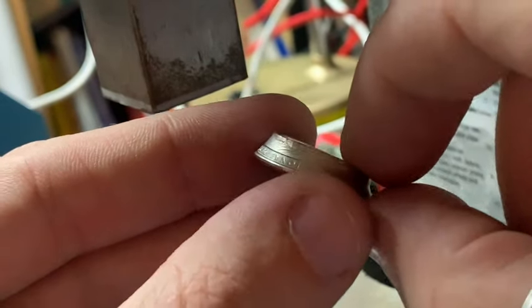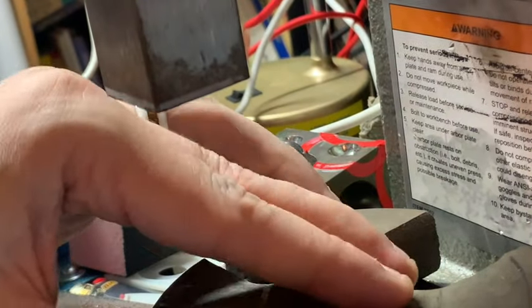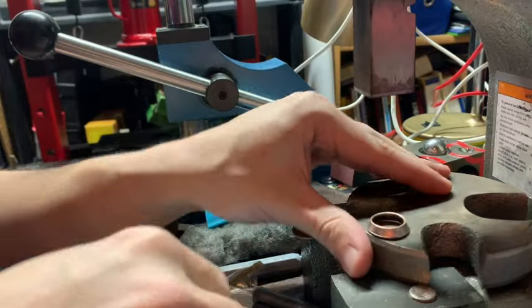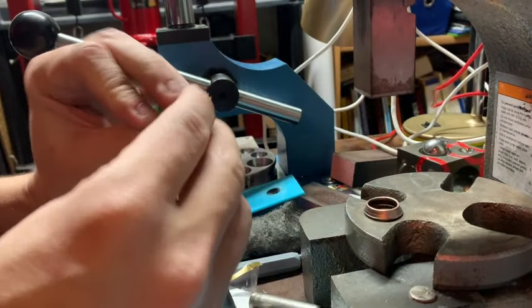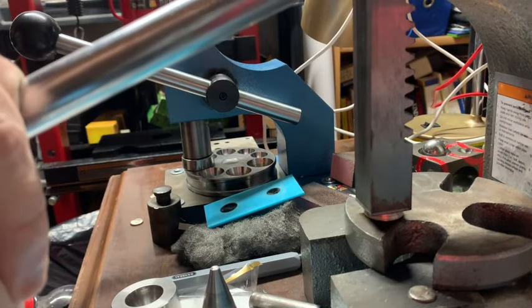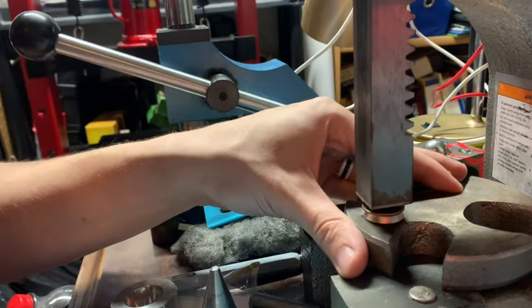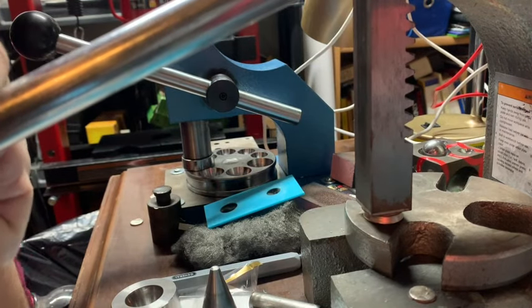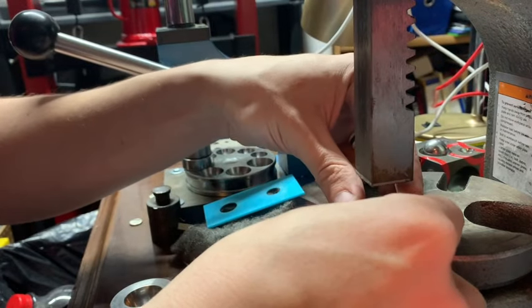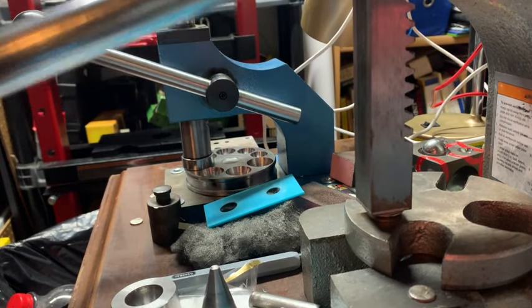This one I'll probably have to flatten. You can see the curve on that edge right there because it didn't fold evenly. When that happens I'll go back to my one-ton press, lay it down, get another quarter, put it on top, and try to even it out — apply pressure and rotate it around. These are just extra steps you don't need to do if you can get that doming block and folding ball. It's just a headache and makes your rings a little more difficult to work on.